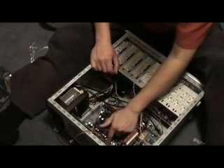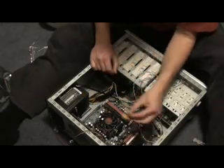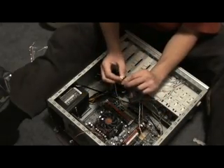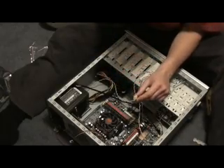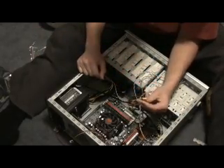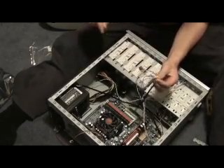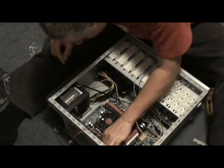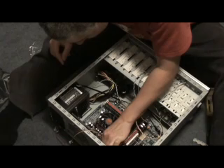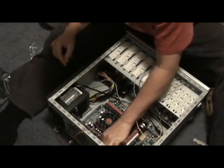If you look around a bit you'll find F-Audio, which is front audio — as we saw before, F-something is for front something. F-Audio is for the front audio. There's a pin hole missing from this one so it can only go one way. Just carefully plug it in. Be very careful — these pins are very delicate; they don't like pressure.